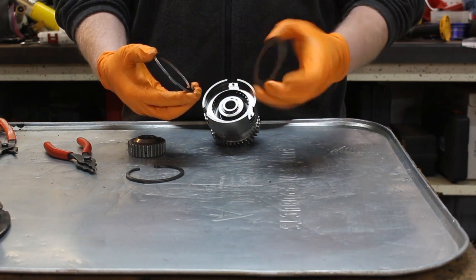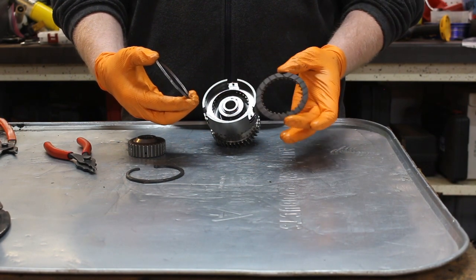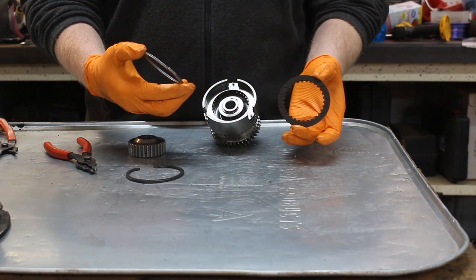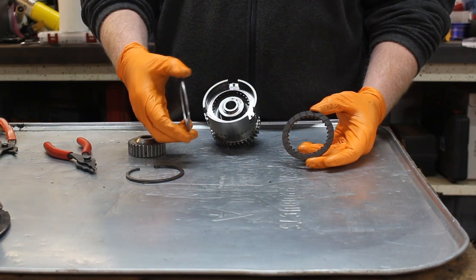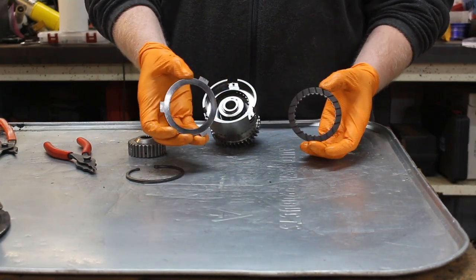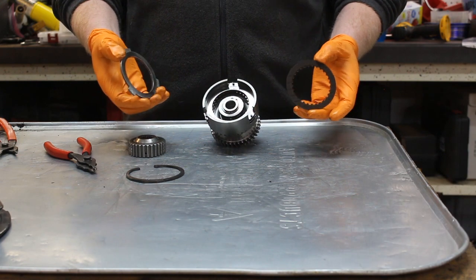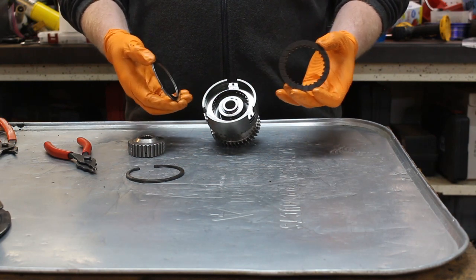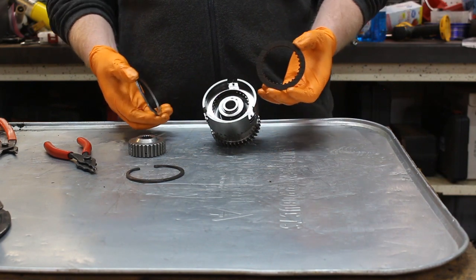What will happen is, if you don't have enough pressure on your clutch and you engage a heavy implement, this clutch plate right here will chatter against the pressure plate. When it chatters, it creates excess wear on this clutch ring right here. If you want to rebuild it, it's going to cost you $200 to $300 just with new plates and stuff. It's better to go find a used unit, but it still takes about 10 hours to pull the transaxle out of the machine, take it apart, and put it back together.